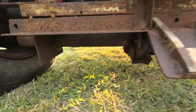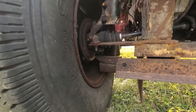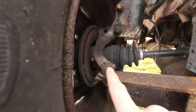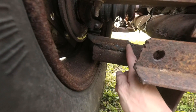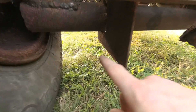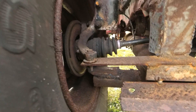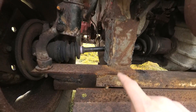I think it's unique. I'm not sure if other people have done this before, but for a homemade tractor it's not a bad idea because you don't need the suspension anyway. I've just locked off the steering knuckle — just cut the control arm with the ball joint on it and welded it right to this pipe. Then I've put this plate on here to attach to the frame.